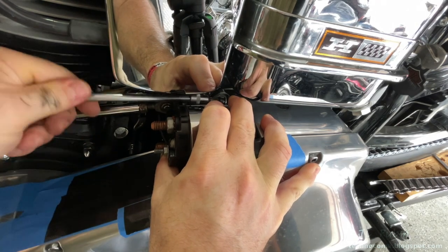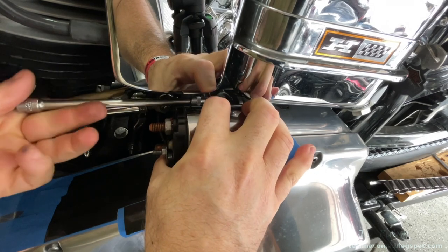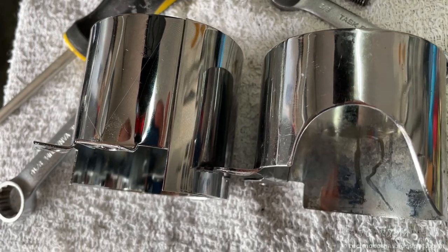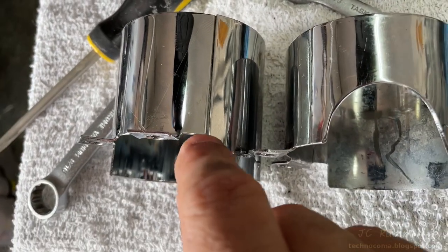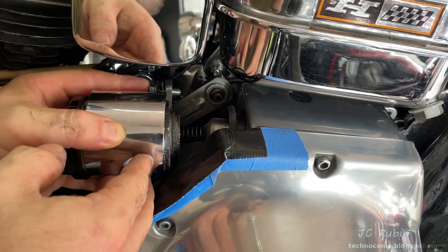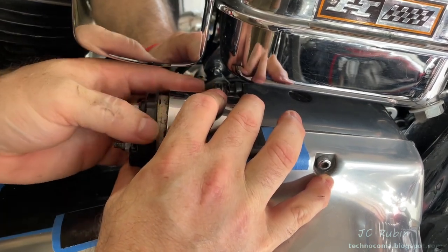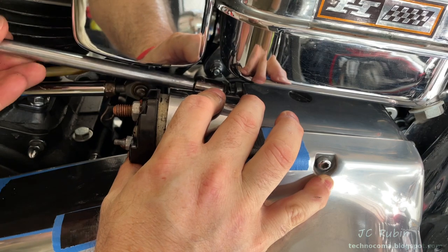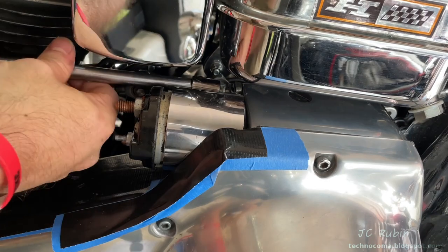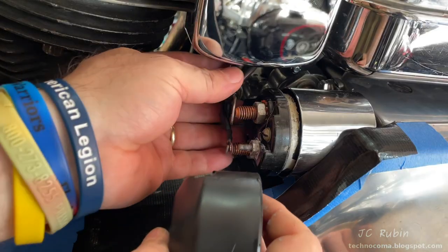As I'm turning it in, something's telling me that it's binding up somewhere else — something's wrong. I stop immediately because I don't want to cause any damage. Taking both out and re-comparing them, I see the depth from the screw holes to the end of the cover is entirely different on this JMP product. The old cover is going back in because the tolerances on the new one are really poor.